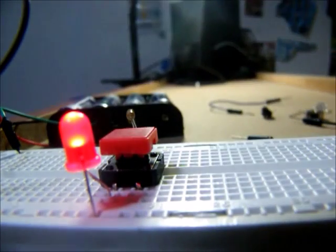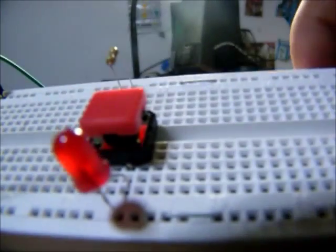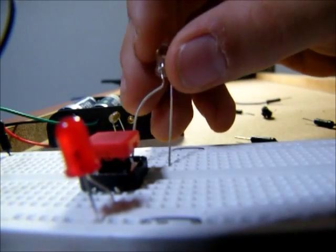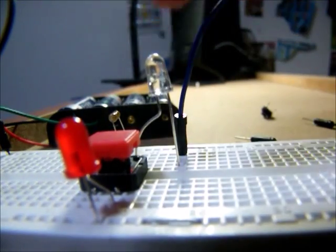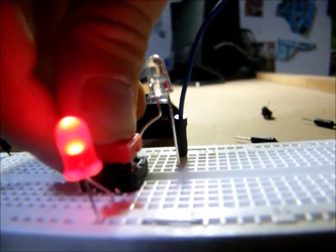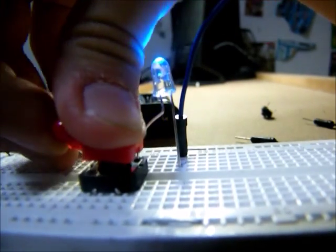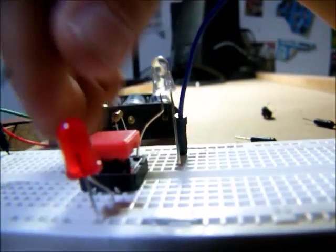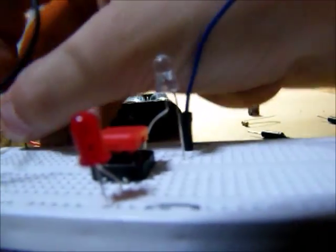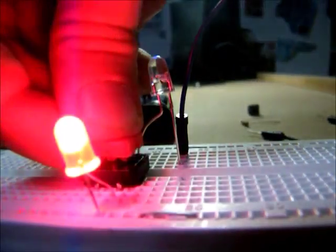It's already on because it flows automatically through. So, to make the button useful, I'll have to plug it like this — now, when I press the button, it turns on. That other leg is being powered over there. So I'll grab another LED, hook it up there in that same column, then get a wire in that same column back to the negative. Now when I press the button, they'll both turn on. But electricity finds the easier way to flow, and it flows through the red one because the red one has less electricity taken away. So, after I take the red one out, it flows through the blue when I press the button. I'll put the red one back in, and take that resistor out. Put the green wire in here to see them both turn on — they are both turning on now. The blue is still pretty dim because of electricity, but at least you can see a bit of it.